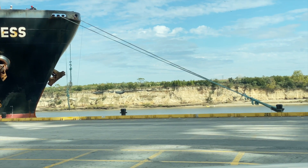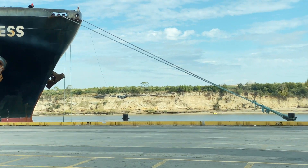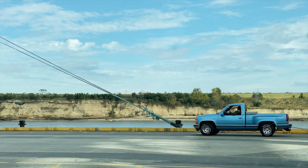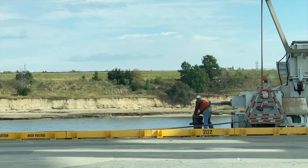The last set of lines being sent now are the two offshore headlines. This will complete the mooring operation on the bow and leave the ship in what's called a 4 plus 2 configuration, meaning four headlines and two spring lines.